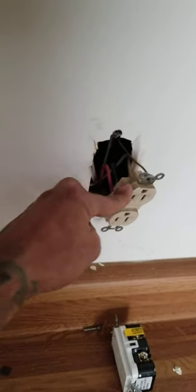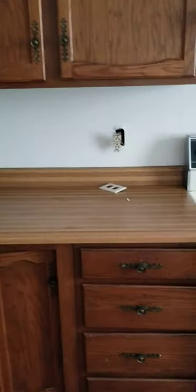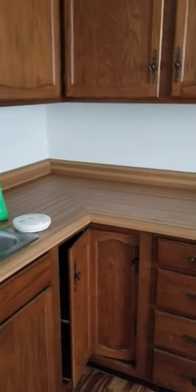What we are doing today is just eliminating that red wire — put a wire nut on it, throw it off in the back, install our GFCI, good to go. We got another one over here, so that means there are two little outlets in here. Personally, I'd probably put one right there and then another one like up there for a light. Anyway, just wanted to give a rundown on GFCI outlets — that's it.